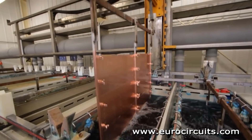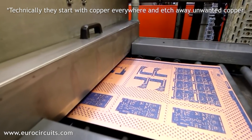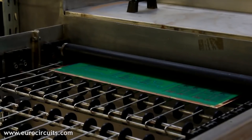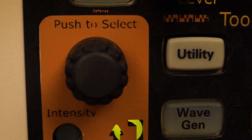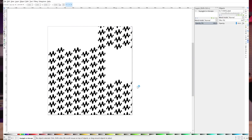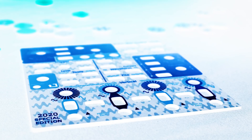So the FR4 is your first color. On top of the FR4, the fab lays down a copper layer — this is usually for traces and ground planes, but we can use it as a copper color. Then the fab puts down solder mask, which comes in a bunch of different colors; this is what gives many boards their green color. For the After Dark, it's actually a clear solder mask, so we can see the copper underneath and get this cool reflective matte finish. A quick warning: in your PCB program, you mark where you don't want solder mask applied, so it's a negative image.